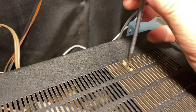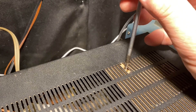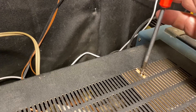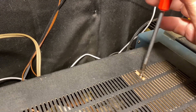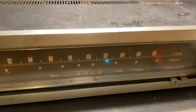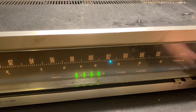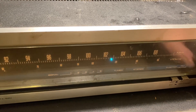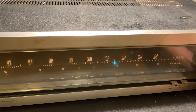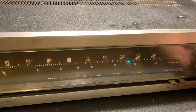I've got to put a knob on this and make it bigger so I can turn it with more precision — the screwdriver is kind of hard. Another thing you'll find is that doing it this way, the capacitance of your body will change the tuning as you even move your hand. But that's the gist of it — it works in a pinch. Have fun. And actually, before we go, we'll give you one final scan of the dial here. All right, have fun and thanks for watching.